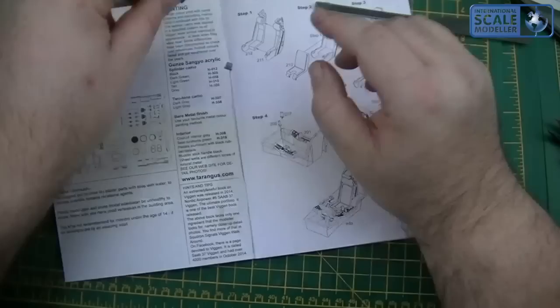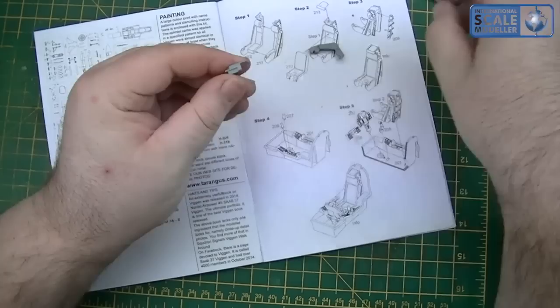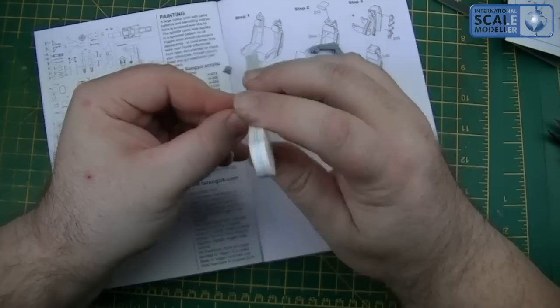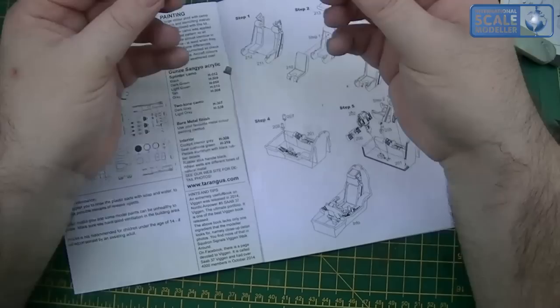Right, so they're all cleaned up. That's the one I cleaned up, is it? That's the one I hadn't. So again, two-step, use your sander to sand the major part off. Then use the green sander on the white polisher to clean your parts up. And then when you paint them, they don't look rough. They should look like you haven't even painted them.